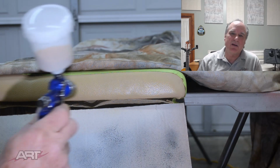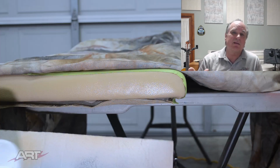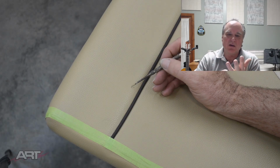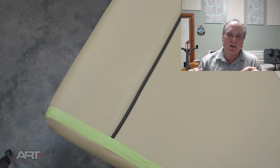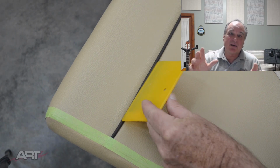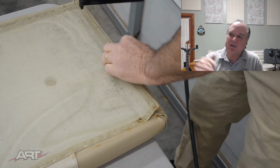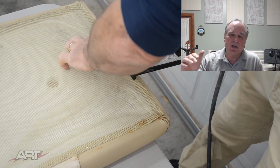Now, what if we still had to blend the repair with a graining pad and a heat gun method? Well, we do that too? Yes, and it works good now. After the ironing, we can use that method. Now, someone may say that takes way too long because you've got 3 repair methods there. You've got stitching, you've got the ironing, you've got the heat gun and grain pad method. You've got 3 repair methods in one. But the end result is it's repaired. And if we have practiced our stitching and we get that done in good time, then we have a great end result. So that's how, in this case with the boat seat and this vinyl, every repair prior to this seat has been a stepping stone.